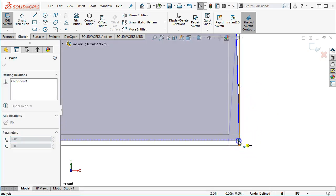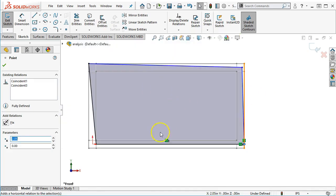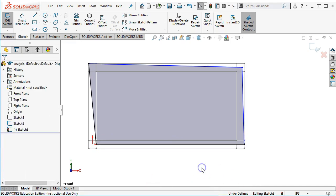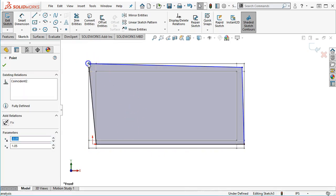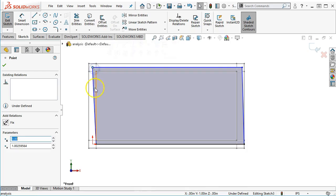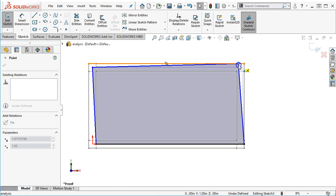All right, so let's look at this side if it was to go to maximum material condition, or sorry, to the maximum of that tolerance zone, which would in effect be a fundamental shift back to the centers, back to perfect form. So if I measure that, I should get 2 inches with no zeros, or all zeros, depending on how you look at it. So I would be shifting over to the start point, and I would still be able to see those tolerances move. Right, so moving through and getting that visual, I can be that much out of perpendicular. This side can move independent, and this side can move independent as my worst case scenario progresses.